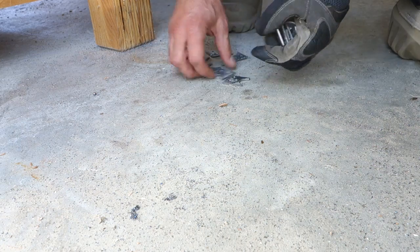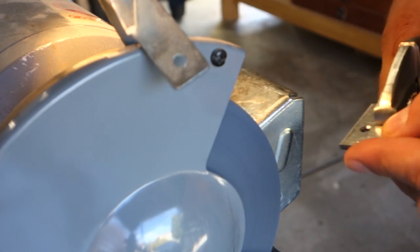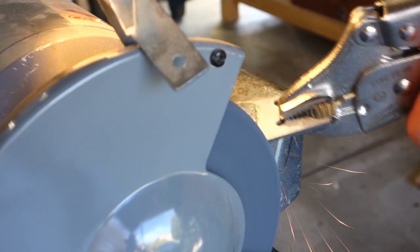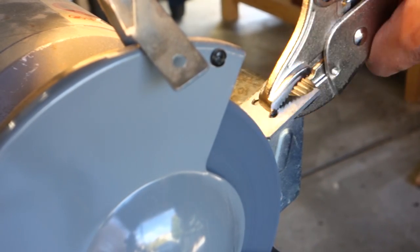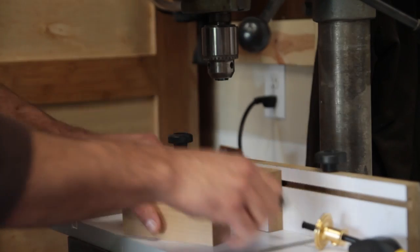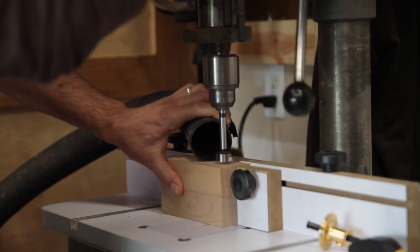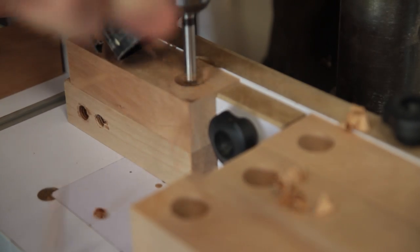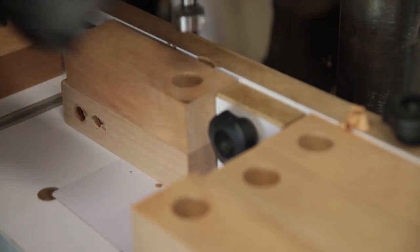The electrical conduit I used worked fantastically — it was three-quarter inch, but the outside diameter ended up being fifteen-sixteenths of an inch, which is a pretty weird dimension. That came into play when I needed to drill all the holes to fit that tube exactly. I had to get a few drill bits specifically at fifteen-sixteenths to work with that stock. Whatever you use, just make sure you have drill bits sized to an accurate measurement of your actual tubing.